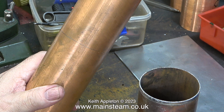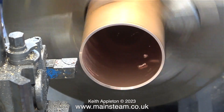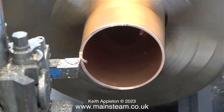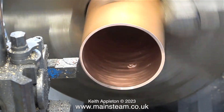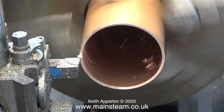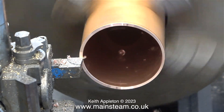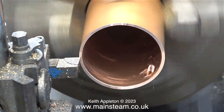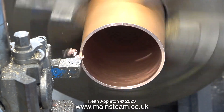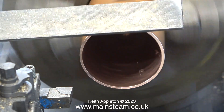Both edges of the tube were rough and needed turning down. Luckily, I have a Smart & Brown Model 1024 fitted with a four-jaw self-centering chuck. Because this is a four-jaw chuck with large jaws and a very large hole down the centre, I can put most of the tube in place and turn it just like this. If I was using a smaller lathe, I would need a solid plug at one end and a specially shaped piece of metal with a centre hole drilled in it for a live centre to hold everything rigid. But thankfully with this chuck, it's rigid anyway.